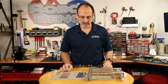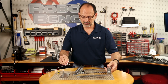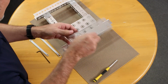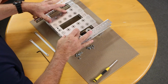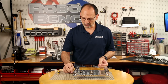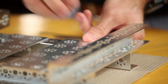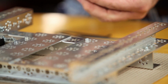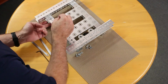of my base. So I'm going to take my base, I'm going to turn it over, and I am going to add these plates just like this. And again, make sure, watch where I'm putting those standoffs, because again, we are creating that mirror situation because we're building symmetrical. And I'm going to start on one side, and I'm going to put, again with my shorter socket head cap screws, holding my cap nuts. And again, this is where you'll see how easy it is to access these if I've got these channels pointed in the right direction.